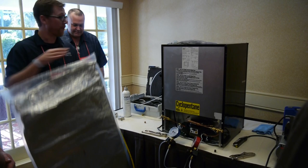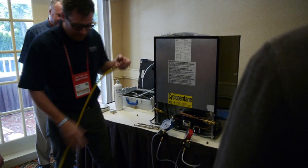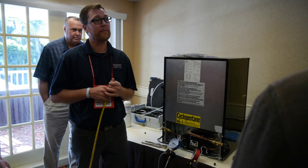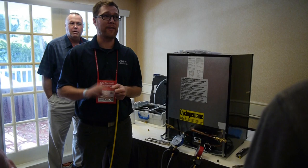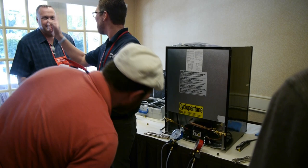This one, if you notice, has a metal liner in it. If you put it in the truck, it will still have the refrigerant in it. As far as pressure-temperature relation of R600 in a hot truck — you don't put it in the truck. As soon as you're done, you walk right outside and discharge outside. We're using it in here because it's not safe to vent inside — that's why we use the safety bag.